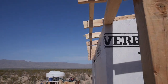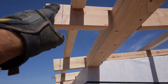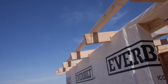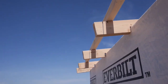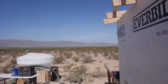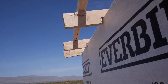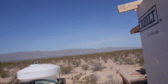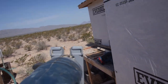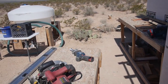Problem is, when I get into here, I don't have room to get a circular saw on that, because this is too close to here. I could do the saw upside down, is one option. I'd have to set the angle. The other option is probably what I'm going to do: use my jigsaw and cut up from the bottom so I can see my line, and then when I get almost to the top I run out of depth on the frame on the bottom, which will hit that purlin, so then I'll finish it with my little recip saw. It's just going to be harder.